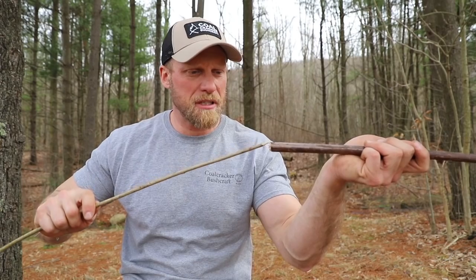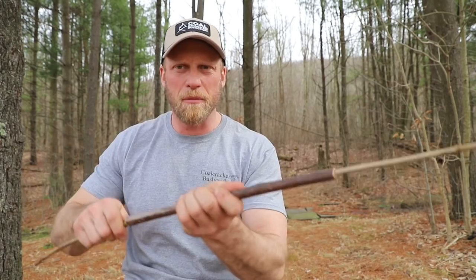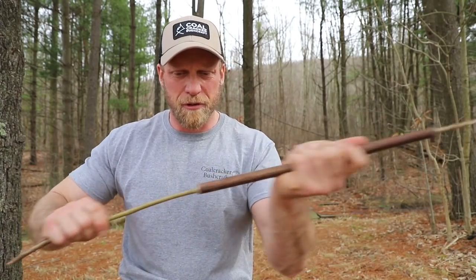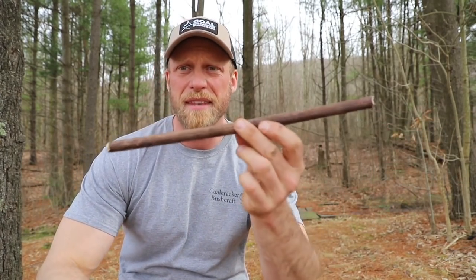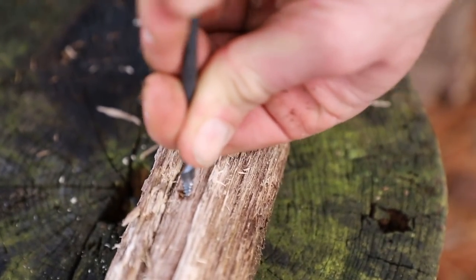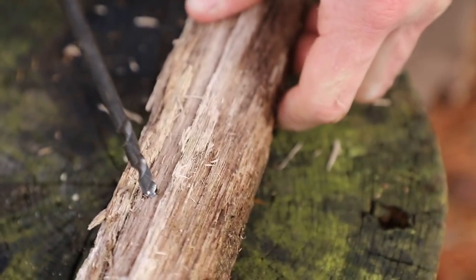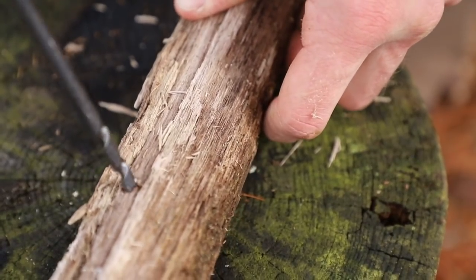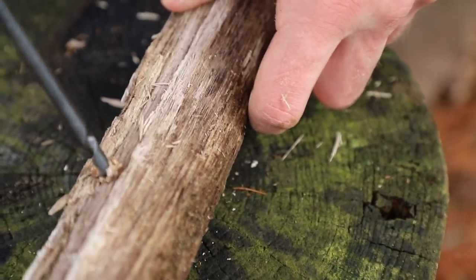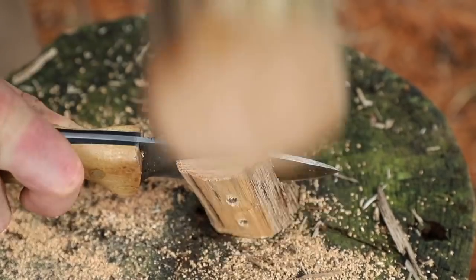Now I can take my sharp stick and just take it down inside and get it through there — just take your time with that, you can see it doesn't take much. I'm going to work that back and forth a little bit just to free that up. Now what I'm going to do is get a piece of wood and put two holes in it. I'm going to use my gimlet on a larger dry piece of wood. The reason I'm using a larger piece is because I'm going to carve it down to what I need. If you use a small stick and a larger gimlet, majority of the time the grain is working against you, so it's going to split out.